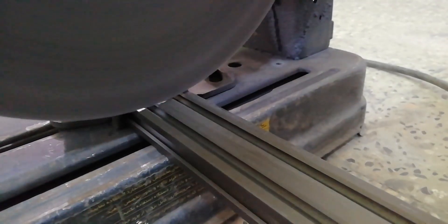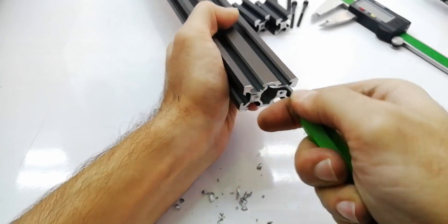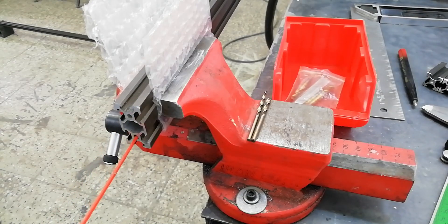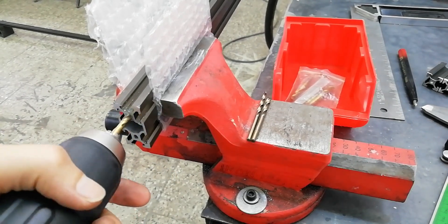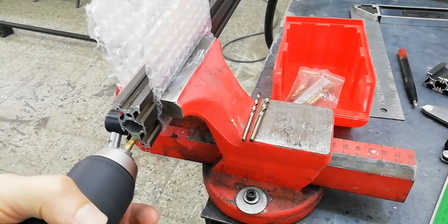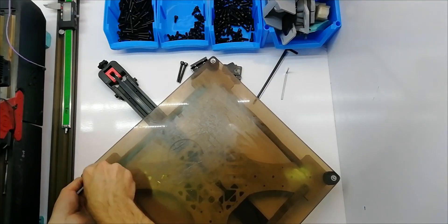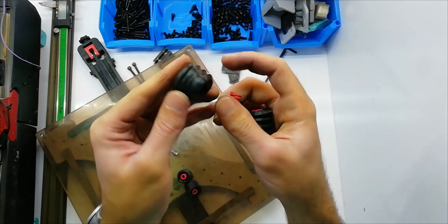Measure the first line, second line, and that's it — then go for deburring. In the design I used the 40-20 aluminum V-slot profile, which is perfect for the movement of POM wheels. Lubricate the hole and M5 threading. Those brackets are not supposed to hook the stepper bracket; we adjust the sides with the calipers, mark and drill. As you can see, this is the old gantry that I designed and printed in PLA.